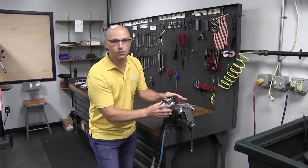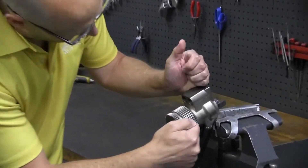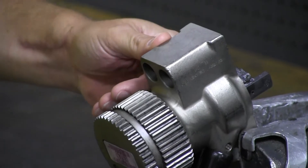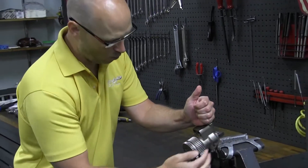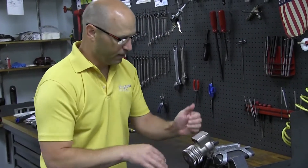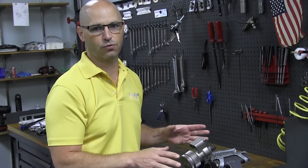Let's take a look at the cylinder here. This is the power cylinder — this is where the piston is inside. All the pressure is here. We have the same thing with our tools: a power cylinder, then a link or head. On this tool, the power cylinder has the piston in the back area. The piston moves forward and backward — advance and retract — with a hose going in. High pressure pushes the piston forward and low pressure pushes the piston back to reset it. This particular tool is cast, which is something we do not do — we don't cast our tools.